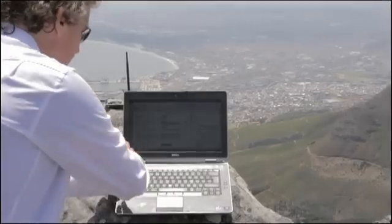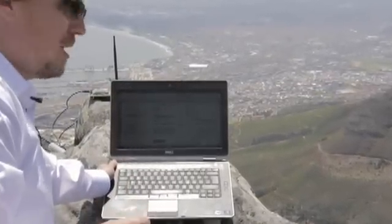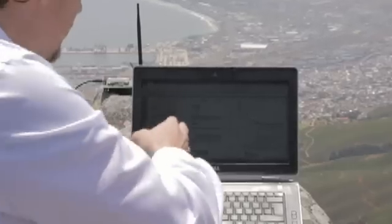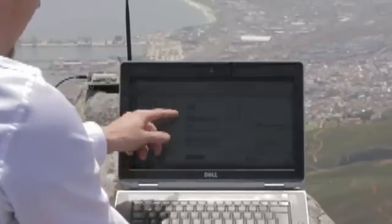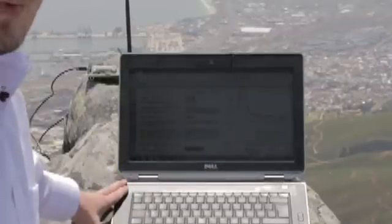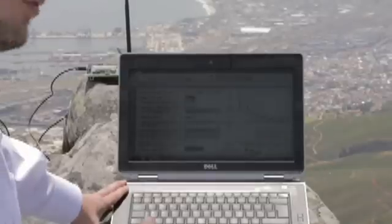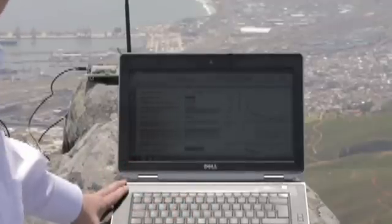A bit of the theory behind the range. At the top we've got the TX. This is the height of the antenna above ground — we're 1,000 metres here on Table Mountain. My colleague Rodney is down the coast at a 1 metre height. We're operating at 868 megahertz. We have an output power of 27 dBm, and the sensitivity of the CC1120 with the CC1190 is approximately minus 125 dBm. So the range is approximately 70 to 140 km, and that's the distance we're trying to achieve today.